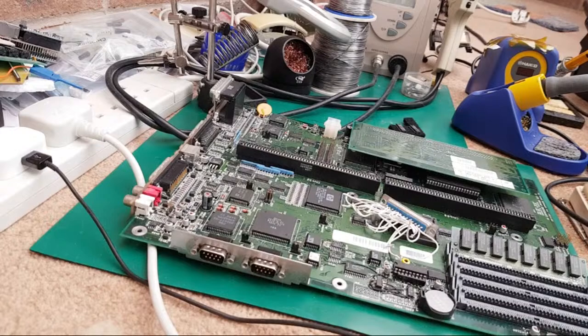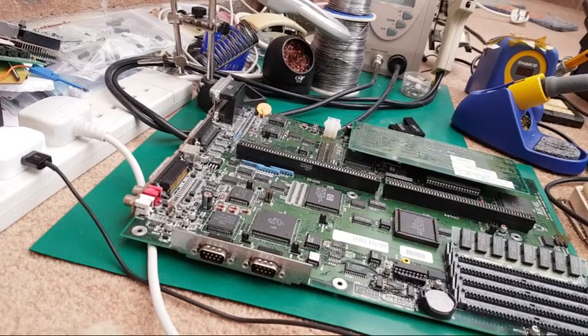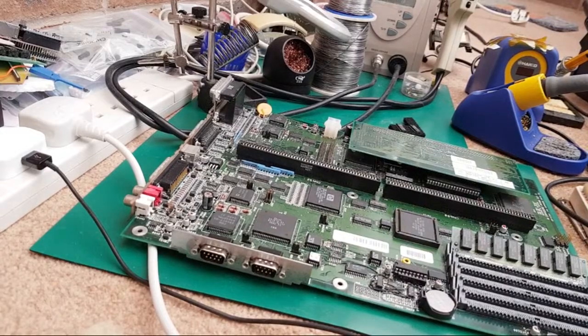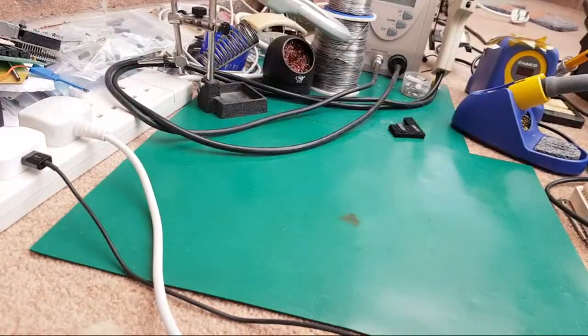PC, I'm looking at A4000 schematics, so it looks like A4000 has MC1488 and MC1489. Just SMD version, U304 and U305. Thank you very much for posting that, because that now makes things super easy, doesn't it? We can have a quick look, I'll zoom it in. Let me just see if I can find where those are. U304, 305, I think he said. I see them.